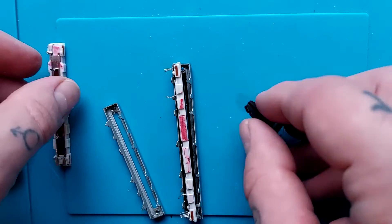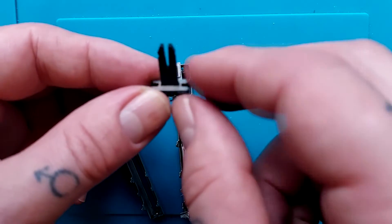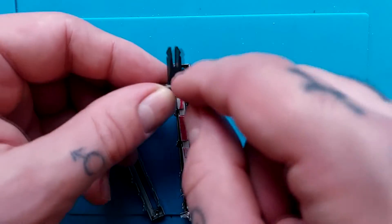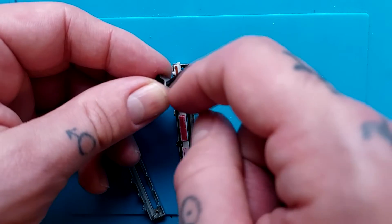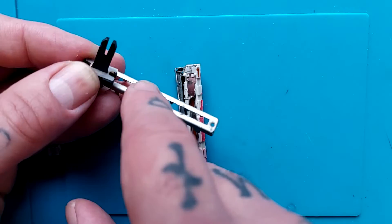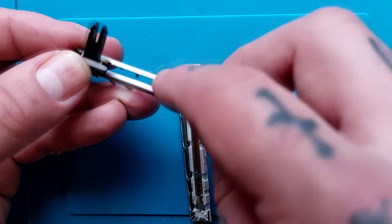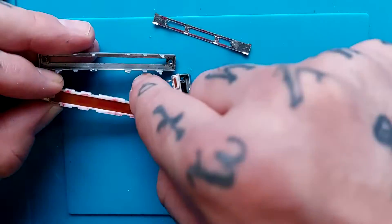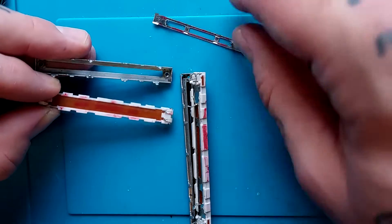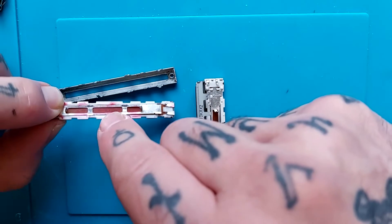There's a casing on top and inside there's a slider. The slider will typically have a little metal spring that keeps it tight to the top of the case, with a plastic separator so that the metal spring doesn't conduct to the metal casing, which is usually connected to circuit ground. It's connected to circuit ground by the way it touches these plates at the bottom.